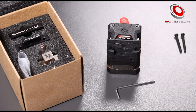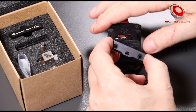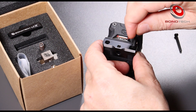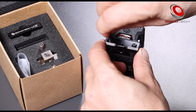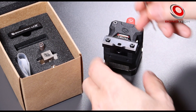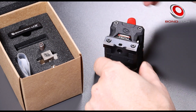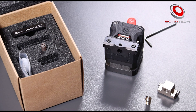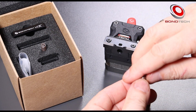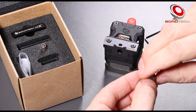Now we're going to install the LGX for Flexibles set. We take the cold block from the box, install it on the interface socket, and tighten the two screws but not fully. Now we take the nozzle out of the box and the Copperhead hot block as well. We get the nozzle into the hot block — don't screw it all the way in; we leave some room for the heat break for now.